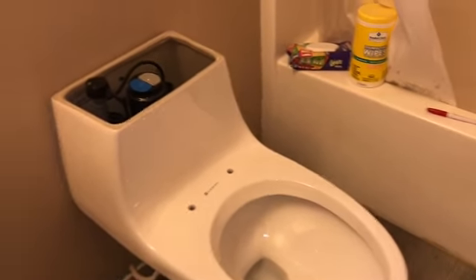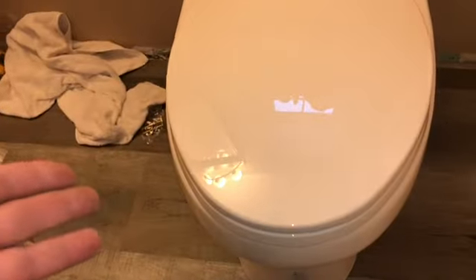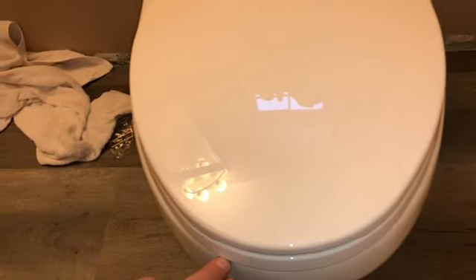The toilet came with a toilet seat, which is nice. Read the box before you buy — make sure it includes the wax ring and toilet seat, or you'll be making another trip to the hardware store. Install the seat bolts with a flathead screwdriver, holding the underside with your hand. Before fully tightening, make sure the seat is centered where you want it — stand and feel the lip on both sides to confirm it's even — then snap everything together.